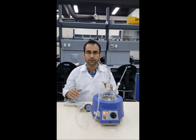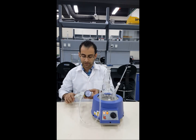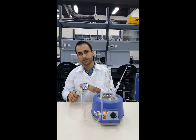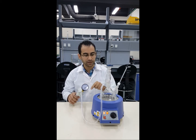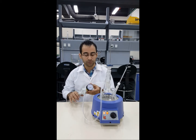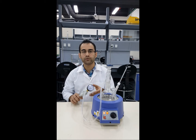Then we'll reduce that, recording the boiling point of water each time. Boiling point means whenever the water starts to boil. We use this hand-operating vacuum pump to produce vacuum; a gauge is provided. This pump is designed to hold vacuum at a specific pressure. Due to the fittings, we might lose some vacuum, so we'll need to add a little bit every now and then until the water starts to boil. When the water starts to boil, we'll need to add some vacuum to keep it at the same point. We will start with minus 0.7 bars and wait for the water to boil.